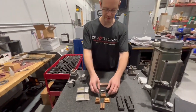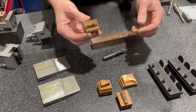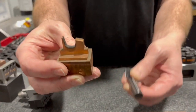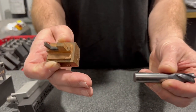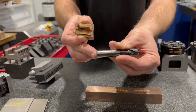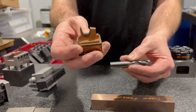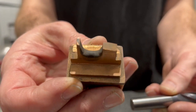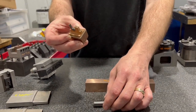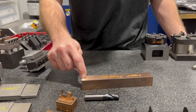This brings us to the next point: copper on carbide is not the best combination. I set up a copper electrode and tried to burn a cutter in half to shorten it — I burned about three-quarters through the carbide, and the copper literally wore away to almost nothing after an hour and a half to two hours. It did burn some carbide, but very minimally. Most of the wear came right off the copper. If I needed to do it again, I would use copper tungsten.